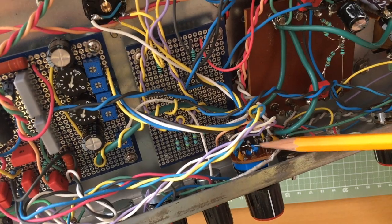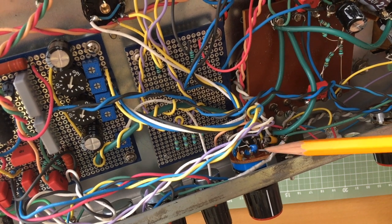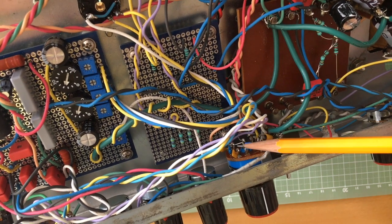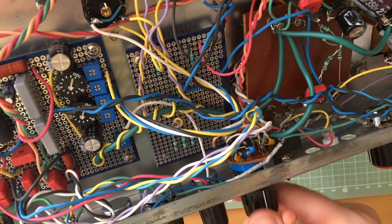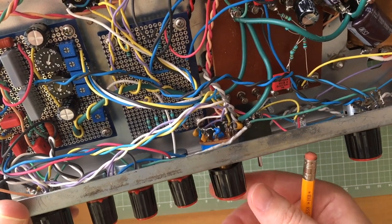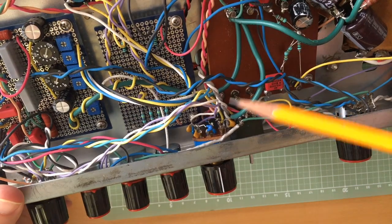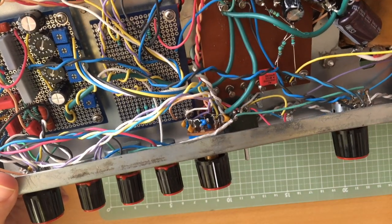It's a 5-position double rotary switch, and I wire different caps depending on the position, going from no cap for darker to a large value at the brightest settings. And I will actually measure them and put them in the schematics too.